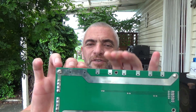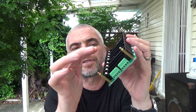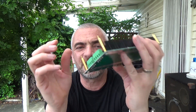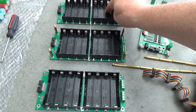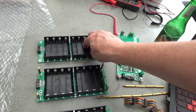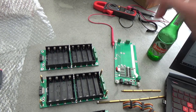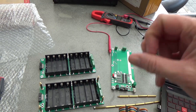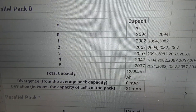These two are clearly connected together so that's obviously our parallel set. There are four parallel sets in here to make up the 4S, so that would suggest 2, 2, 2 and 2 — which also means that the first two here are going to end up in parallel with the first two in the other two sets. So I'm going to arrange them like this, which means that this here is a parallel set of six. These two cells, these two cells, and these two cells are a single parallel pack of six — so the six cells put in here are going to act like a single unit, or one battery cell.